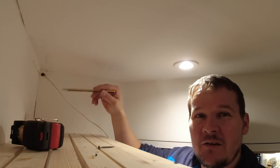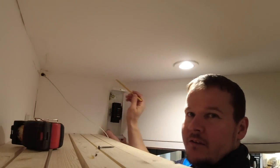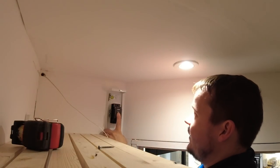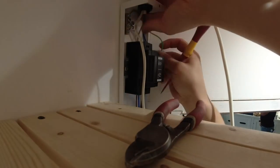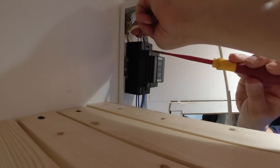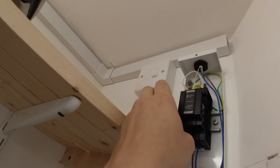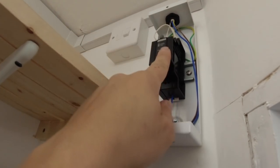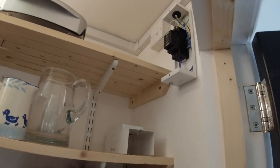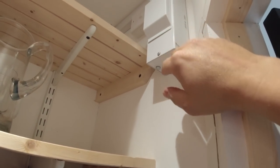Rather than mount the transformer box near the shower, there's a little gap on the wall where we can run some trunking in the top corner and mount the unit neatly on the wall. We've got a new switch spur — labelled 'doorbell' — with a 3-amp fuse, and the doorbell transformer is housed in the metal enclosure which we've earthed. We're ready to power up.